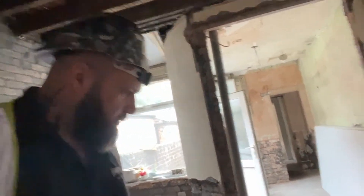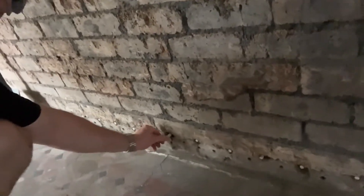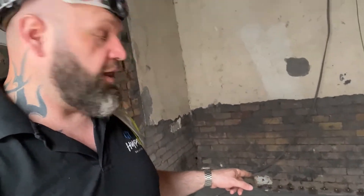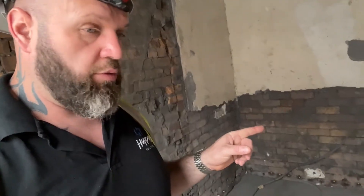I'm looking for where I've pulled this out so I can put it back in. Oh, I love that — look at that action! The reason I like to use these is because if I aren't doing it myself, you can get stuff in a cream, but what you have to do is only drill through three quarters of the brick. The idea is the back part of the cement is still left in.